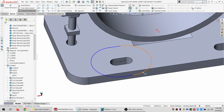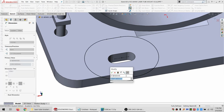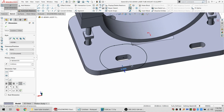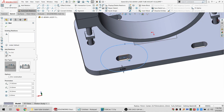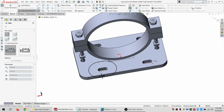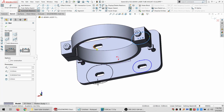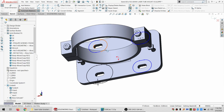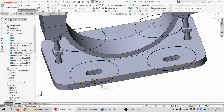All right, so this is the area that the thumb wheel is going to be in. And I can control it by first of all saying that I want it to be at least, for comfort's sake, I'm going to make it 5 millimeters out from the edge of the plastic. So if it's all the way slid forward, it's here. If it's all the way slid back, it's there. Otherwise, it's somewhere in between. And I'm going to do that multiple times. One more. So make these equal. And that does it. All right.